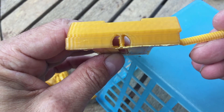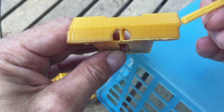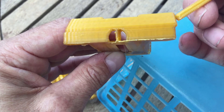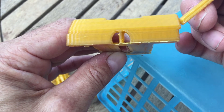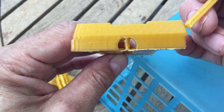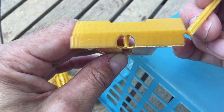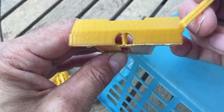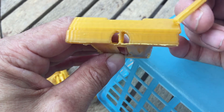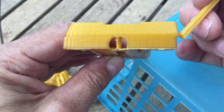As it's going up, everything gets tilted to one side. It could have gone back again if it had gone the other way. There are ways in Cura you could stop that — in Cura you can set it so after it does a layer, it comes up a bit before it does the next layer, so it's always rising before laying down again and never accidentally hits the extruder. But the mechanical fix is the best way.